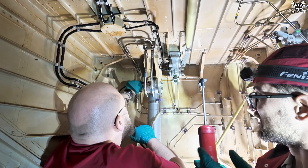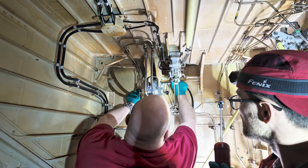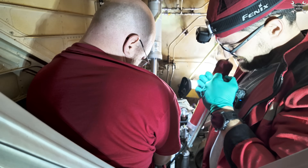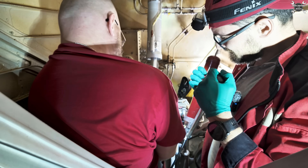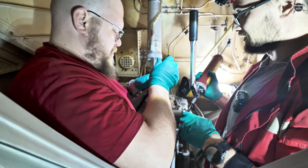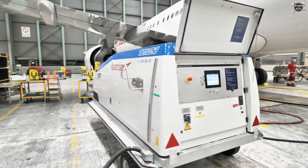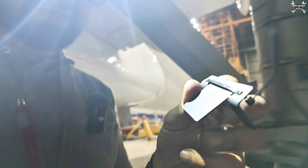All locked. One of the last things is lubrication of both ends of the actuator. After lubrication we service the hydraulic system and pressurize the hydraulic reservoir. After that we connect our hydraulic ground cart, prepare the airplane for the air configuration, and install devices called targets on the main landing gear proximity sensors which are responsible for the air-ground signal. The reason for this is that we want to trick the LGCIU that all three landing gears are in the air since we will jack only the nose gear.